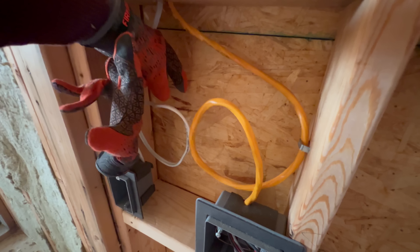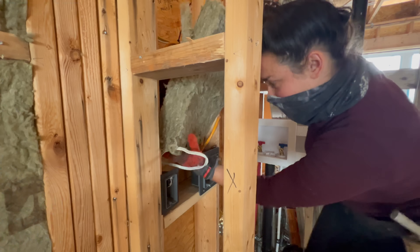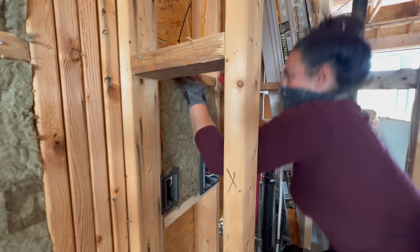I'm an hour and a half in, finished one room and half of the bathroom, and used four bags for this whole room. Now on to a trickier wall — look at how many wires there are. I'll probably cut this batt in half sideways, shove the back piece in first and then the front piece in after. Next up is my materials and supplies room — there's so much going on in here, from scaffolding to garbage to extra plumbing parts. I need to get everything off the exterior walls and insulate this room.